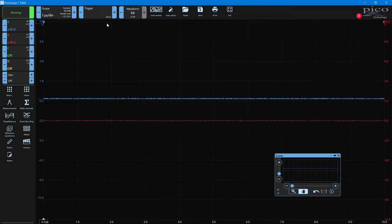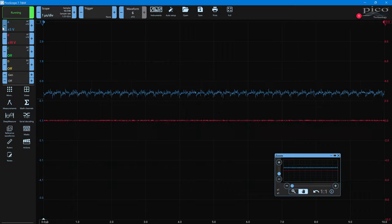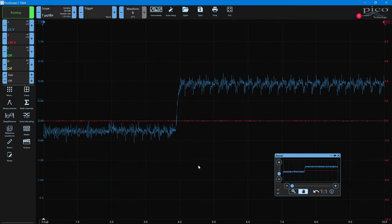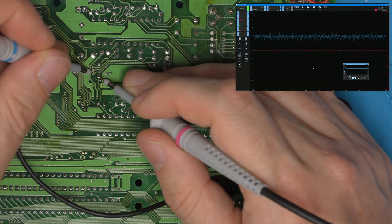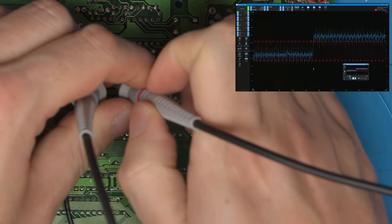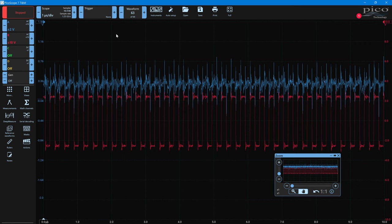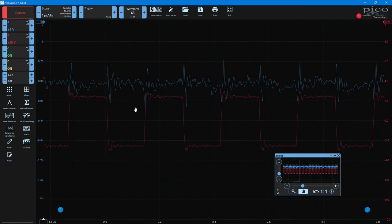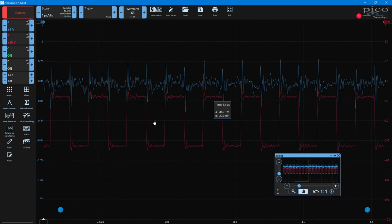So if I probe the red channel there and lower the voltage back down so we can see. Now if I probe that pin right next to it here, and if we capture that now, so I hold them in place and just capture one of them waves, and let's take a look. That now aligns absolutely perfectly. Every single pulse on that clock.